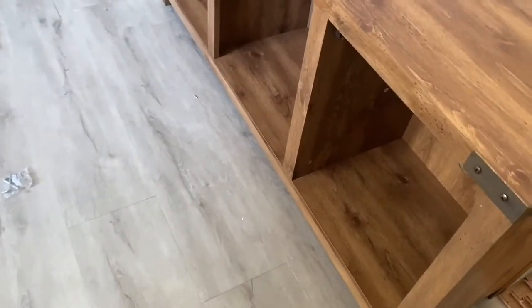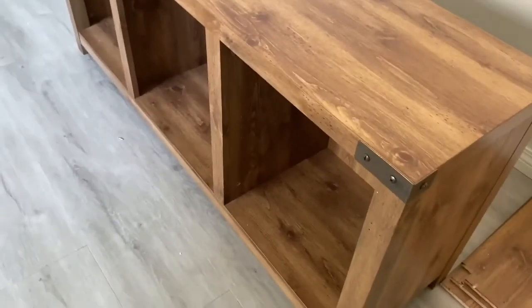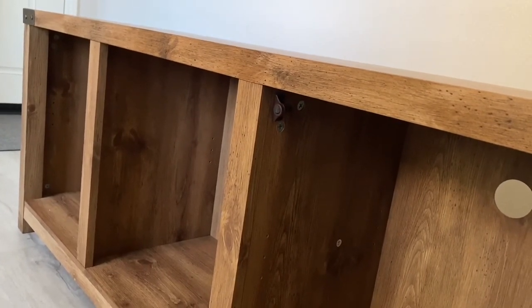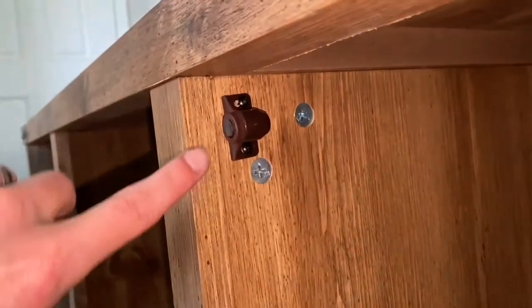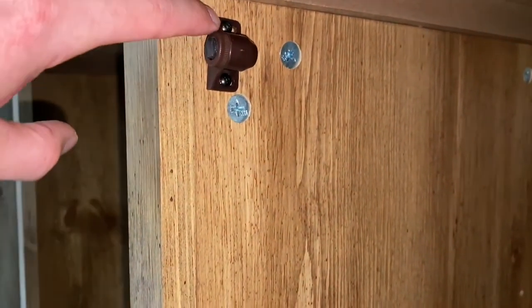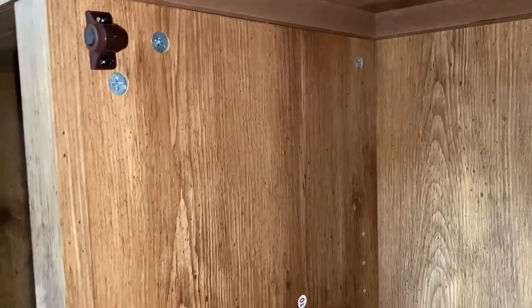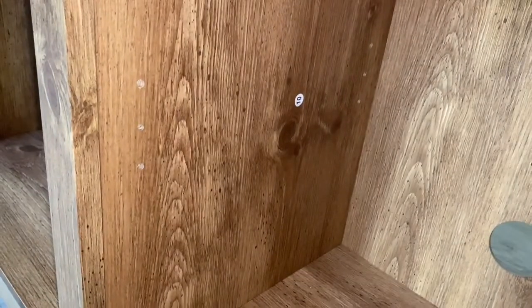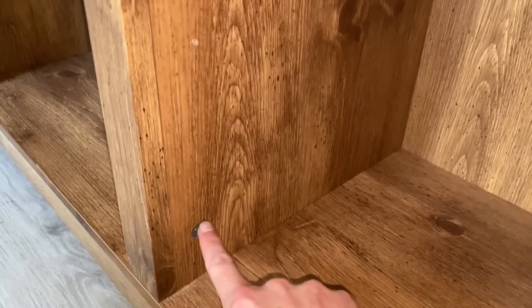Okay, I gotta point something out right now to help you out. You can see I'm farther along in the assembly, but I gotta show you this because I didn't learn this until this part of the assembly, and that is step 14. I want you to turn to step 14 if you have the instructions. Step 14 is the installation of this part P along with screws Q, and pre-install these right now. Get piece 10, get piece 9, get part P, and get the screws Q, and put those in right now. And what you're looking for is a large hole in the corner down here.